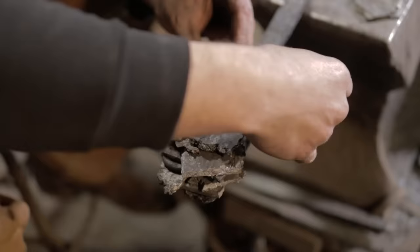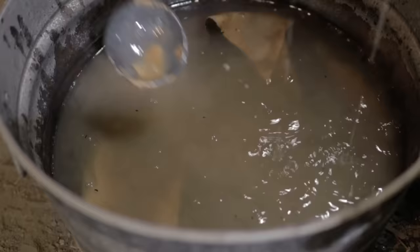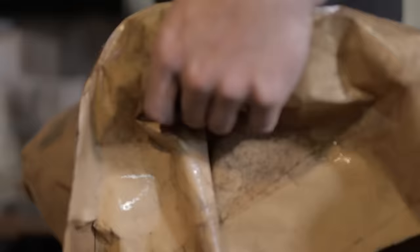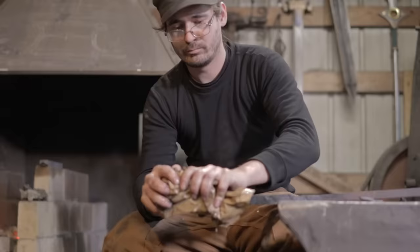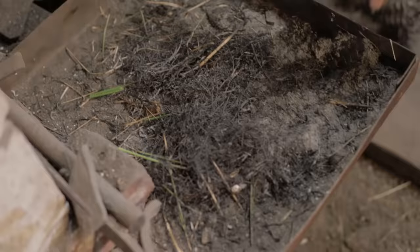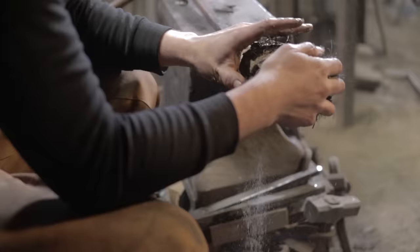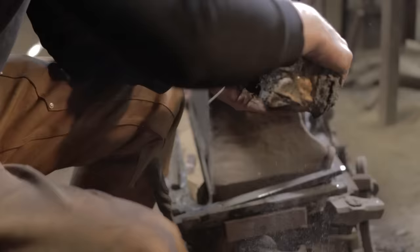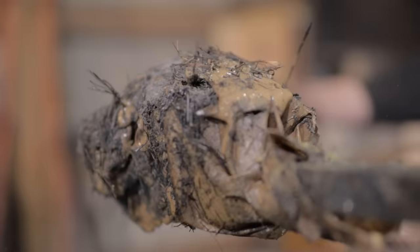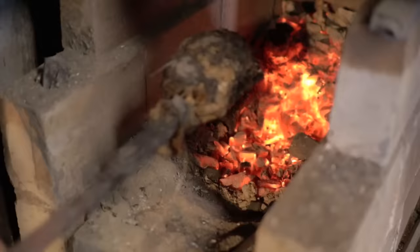Roughly, the process of making a Japanese sword begins like this. The smith takes a piece of bloomery steel, or tamahagani, heats it up, flattens it, and sorts it into roughly two categories, medium hardness steel and high hardness steel. These roughly correspond to medium carbon and high carbon. Then the smith begins to stack both categories separately and fold them until they become relatively homogeneous.